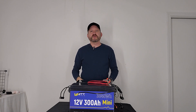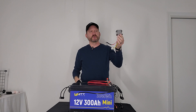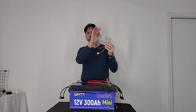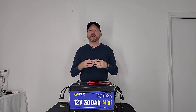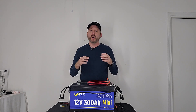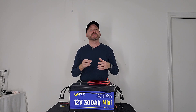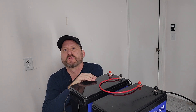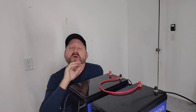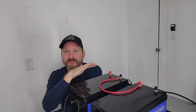People ask about running their 12-volt appliances in a 24-volt system, and that's really pretty easy. You've got these little voltage converters — buck boosters — that will reduce the voltage from 24 volts down to 12. These are about 20 bucks. However, a lot of 12-volt appliances like RV refrigerators will also run on 24 volts. So before you get a converter, check the equipment first. Regardless of whether you're going to run a 12, 24, or even 48-volt system, you are just not going to beat the size, weight, and price per capacity of these batteries.